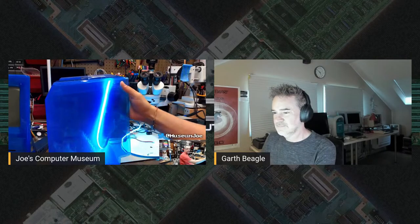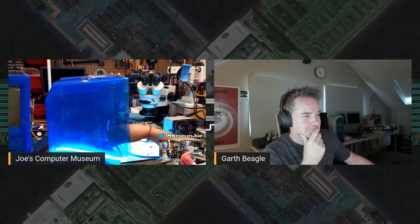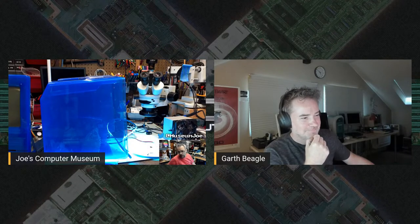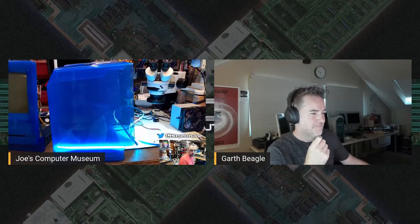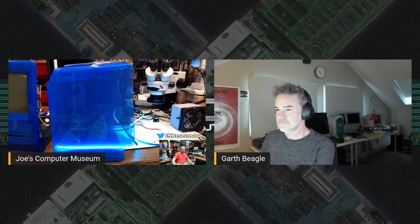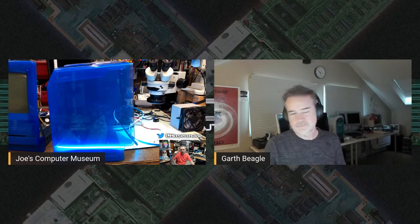Now, if you look at that, to me, that looks way too bright. I don't know about you, but it looks radioactive. And I mean, that's cool. But again, we have to work within the limitations of the power supply, not explode our stuff. You guys can't see that because my name is in the way. There you go. It looks a little too bright to me. So what we can do is go to the voltage and turn it down by like half a volt. Now that still looks good. Right? And now our usage is a quarter of an amp. So that decreased the current usage by more than 50% just by going down half a volt.